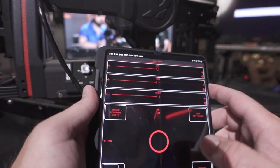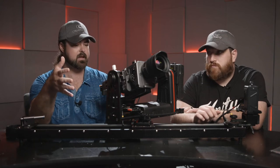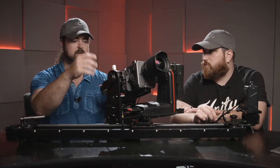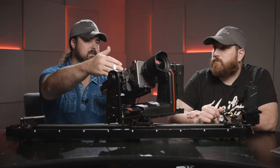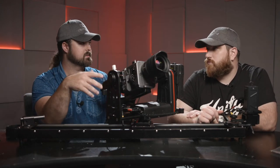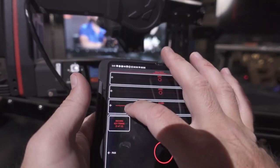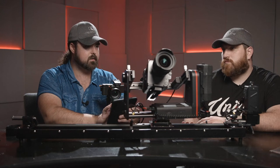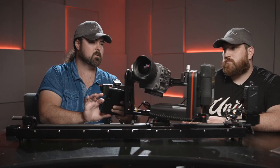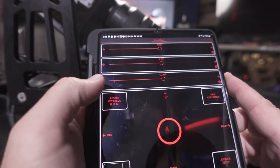One really neat thing we're going to play with is using this as a PTZ — pan-tilt-zoom — head. We don't have the focus motor hooked up right now, but we could use it for focus or zoom. Without the roll axis you'd have two free slots, so with five total axes you could have both focus and zoom motors. Let's record a third keyframe: move the slider over, pan and tilt to a new position.